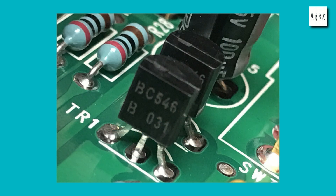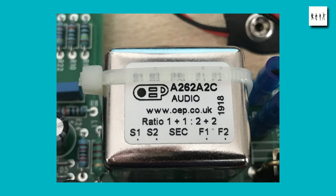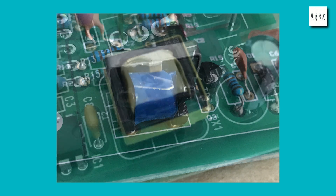There are also a few discrete transistors dotted around. The AR133 uses a BC546 and the Millennium unit uses a 2N5551. To provide a galvanically isolated balanced feed to the output, each unit uses an audio transformer. The transformer in the BSS device has a certain identification label on it, whereas the Millennium one is just a tin box with no markings whatsoever. There are no markings on the inverter transformers in either design either. They look slightly different, and the big M on the BSS device is probably just part of a bit of 3M tape used to wrap the windings.